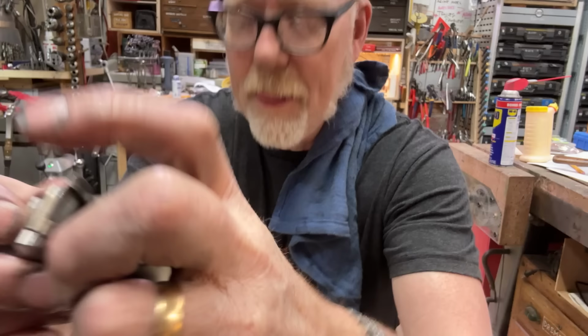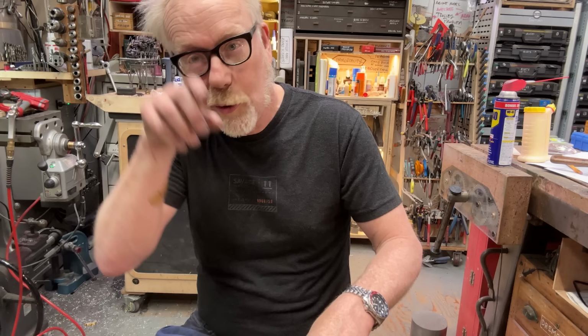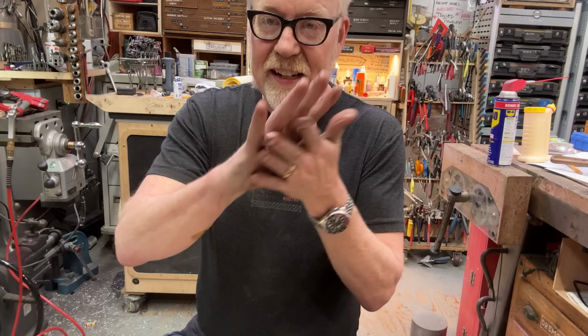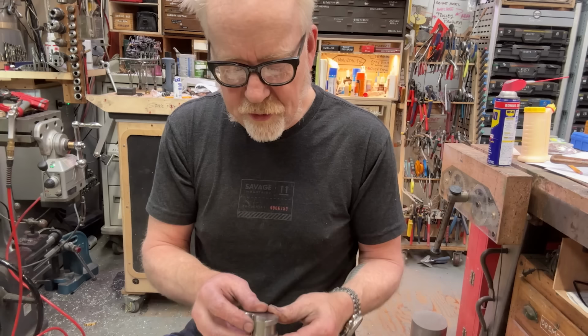When you machine two surfaces, they can feel insanely flat and yet not be. They can feel flat to your fingers, but they might be off by a micron or two, and you can sense that. And so what this lapping compound is doing, this toothpaste of mine, this high-end toothpaste, is going in there and acting as a smoother. So where you have two slight inconsistencies in the surface, which you could hear at the beginning, the lapping compound goes in and smooths that out.